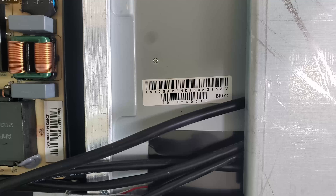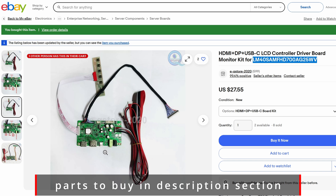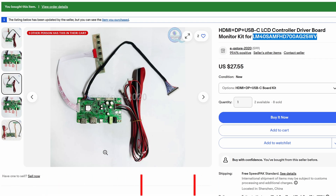After lifting the metal cover out, look at the LCD panel and look for any identification on it. You can see my panel is LM40-something — it's a really long string of letters and digits. Input all those letters and digits into eBay; you need to find a controller for this panel. Assuming your panel is LM40, this is the controller you'll need — it's about $28, not bad.